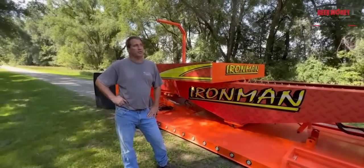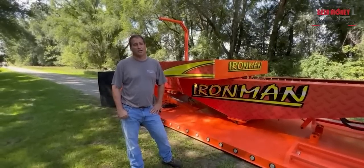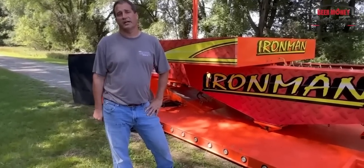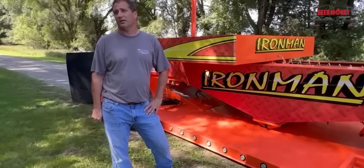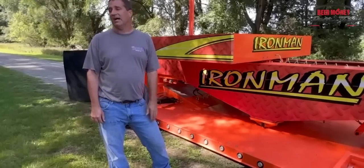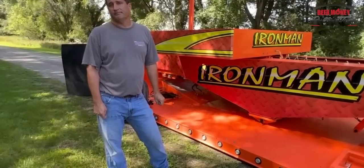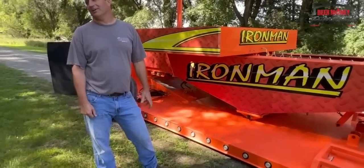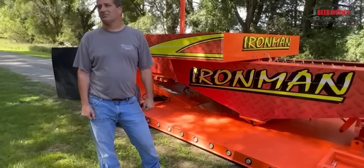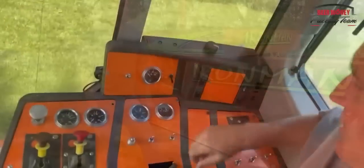People ask if there's a way for us to mess with the puller, and our sleds are built so that if we touch anything in the cab while we're going down the track, there is a relay hooked to every possible switch that turns the red light on. There's no way for the sled operator to favor or cheat anything or anybody at any time on this particular sled. It's good information to know. Yeah, because it does happen where people accuse us of giving an advantage to somebody, and it's just not possible.